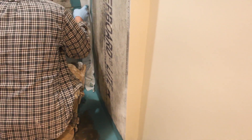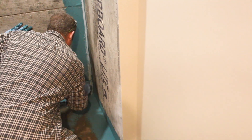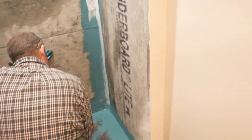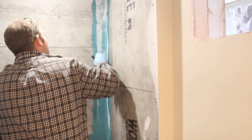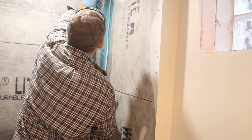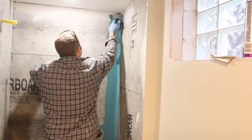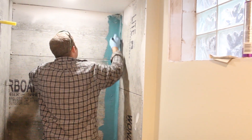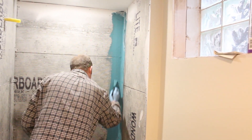As you're doing this, the biggest tip we can give is to apply generous amounts of liquid waterproofing in the corner before you add the fleece. Then as you're applying waterproofing over the fleece, smooth out any wrinkles that form — because wrinkles could adversely affect your tile setting. If you have a wrinkle in the fleece, it could bump out the tile. Constantly check and smooth wrinkles either with a paintbrush or even a 3-inch putty knife, which does come in handy.